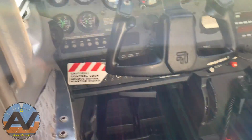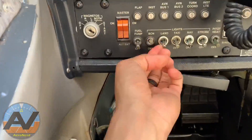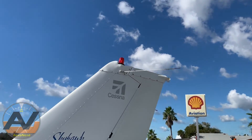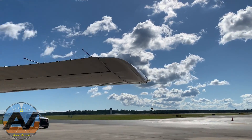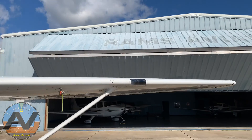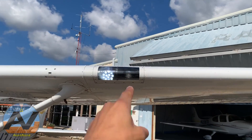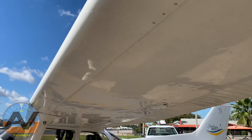Next, I'm going to remove the gust lock, then turn on all the lights — pitot heat and the lights — and go check all the lights to see if they work. This is good. We have our nav lights. You want to do this quickly because you're draining the battery right now. All the lights are checked. In daytime we need our beacon, and we have our taxi light on. The one inside closest to the tires is your landing light. Coming over here we'll have our strobe.